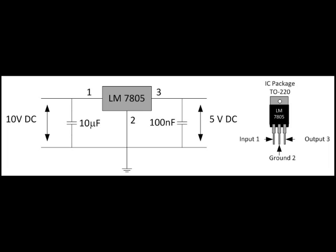To build a voltage regulator circuit, we start by soldering on our voltage regulator IC. We need to be aware, using the IC's data sheet, which leg is the input, which leg is the common, and which leg is the output.